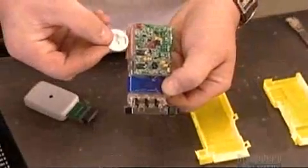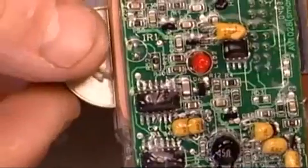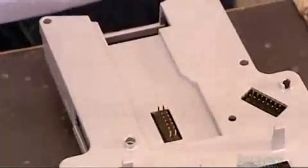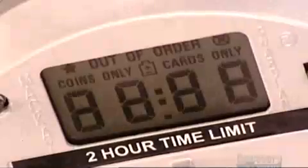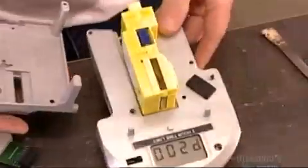The next piece, called a smart chute, also has computer circuitry. It analyzes the coins as they fall through the meter. It can tell the difference between Canadian coins and American ones, and even recognize coins from other countries. He puts the chute into a protective plastic casing and plugs it into the protruding prongs that were used earlier to program the meter. The two boards make a connection and can now communicate to one another.